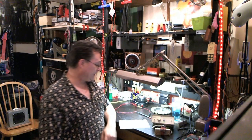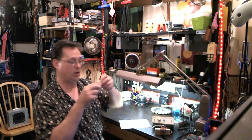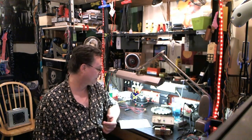When I looked around — I did a Google image search for this type of thing — I came up with a few different designs. Basically they're all about the same thing, but they use different values of capacitors. Some use an electrolytic capacitor that has polarity — a positive and a minus — and that would mean that when you install this capacitor, it runs right through the red wire, and it would matter which way your capacitor was facing, since one lead is plus. The other diagrams didn't use an electrolytic; they used a mylar or a non-polarized capacitor, where it doesn't matter. So you can see these diagrams as I'm going along here.